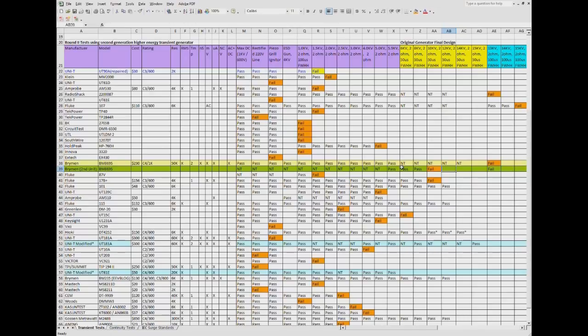So the original meter, what had happened is I ran it all the way up on the low transient generator, and then again the high voltage transient generator was not programmable back then. So I just ran the unit on the 13 kV 100 microsecond full width half height, and the meter was damaged. And again, both meters were damaged the same way. I lost the same set of transistors, so it does look like it repeats. So this is probably roughly what you would expect the meter to fail, at least on my test.